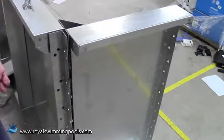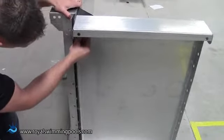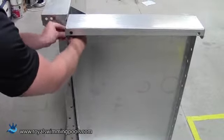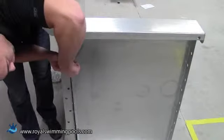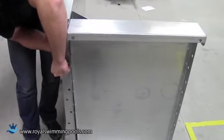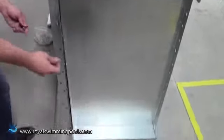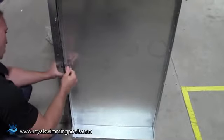Take a few bolts and line up your holes for this panel. Starting at the top, here's our first one. For this process, you only want to get these bolts and nuts about finger tight so that you can still adjust your panels and get everything squared away and measured up properly. Each one of these panels only requires about 5 to 7 bolts and nuts for each side — that's what I recommend for most typical installations.